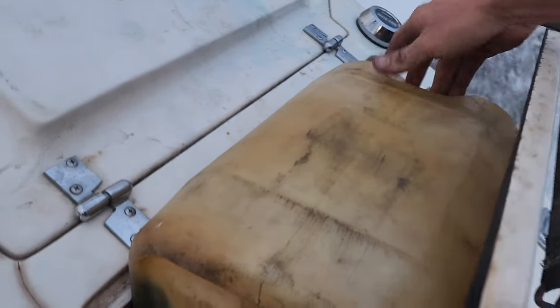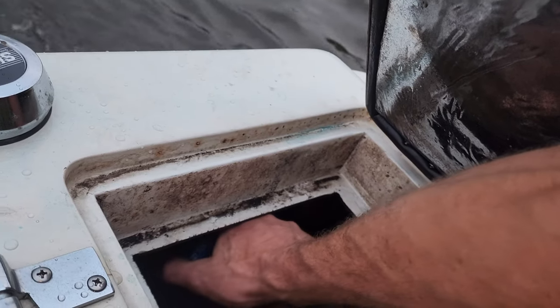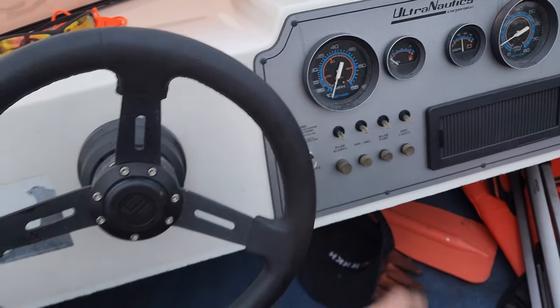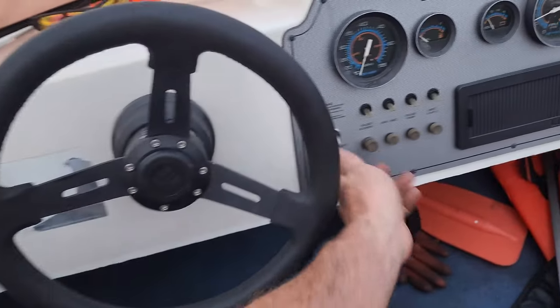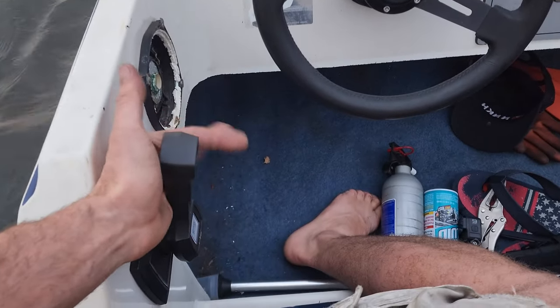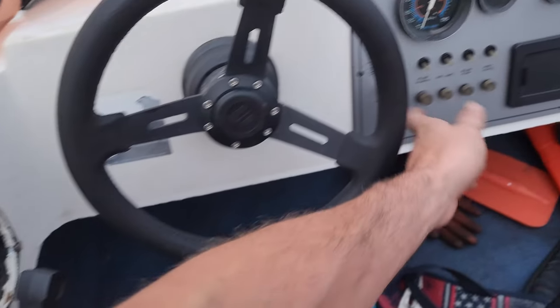This tank has a vent on the top — I see how it's fogged down now. I forgot to turn the fuel off, let's try that one more time. Hey, if it's ever not starting right back up, let me show you one thing: you can't start it when it's in gear because it has a safety. However, if you put it back in neutral, pull out toward you and then go forward, you can start it and work the throttle if you need to.